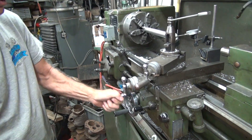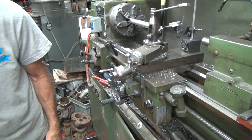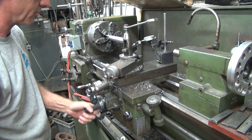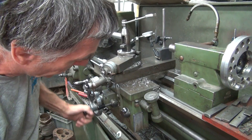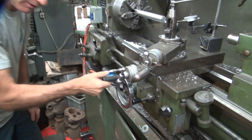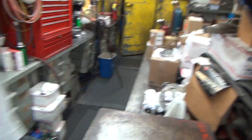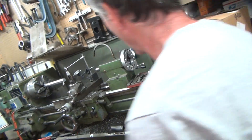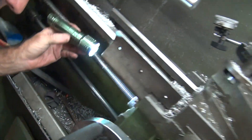Those are two and a half turns right there. It's got more drag on it now. So that's got more drag on that adjustment. Now this one here doesn't have any take-up on it at all. The lock no longer works — whatever was pushing on that has gone. And there's a missing thread on this feed nut. Let's pop the thread off — or tooth. Grab me a flashlight. That's another reason why I don't like using the ultrafine one — it's got a missing tooth.